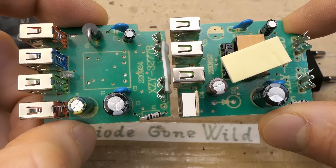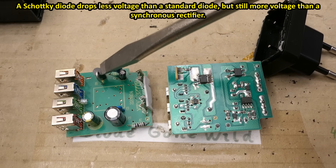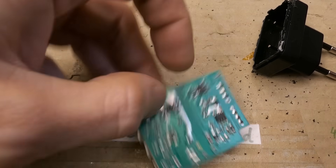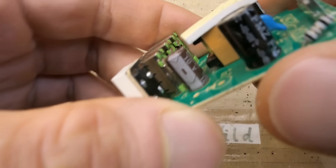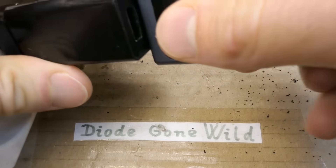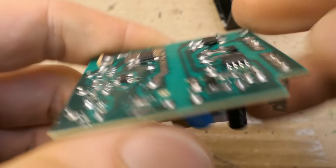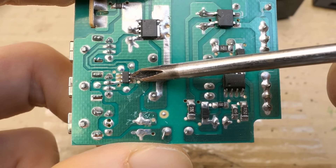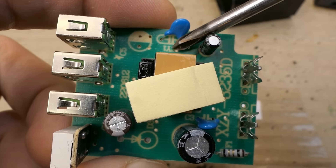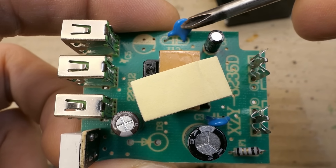It's quite similar to the previous one but there are some differences. It's actually using a synchronous rectifier chip here, instead of the normal diode or Schottky diode, which has much more heat loss than this synchronous rectifier with a switching MOSFET dropping significantly less voltage. This chip isn't in the other one, and also the voltmeter. But it again has just a 10 volt capacitor which definitely can't do 12 volts. Having no optocoupler, it can't change the voltages — this chip just indicates how much current it can supply, but it doesn't have 9 or 12 volt modes. There's again a non-safety capacitor instead of Y1 — just a 2.2 nanofarad 1 kilovolt capacitor in a safety critical application, just like in the first one.